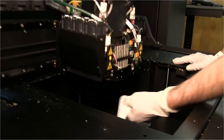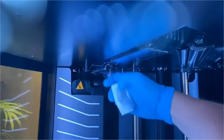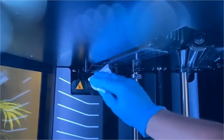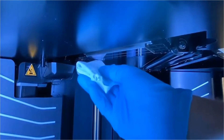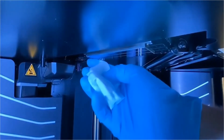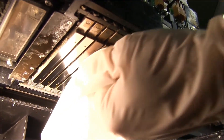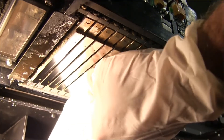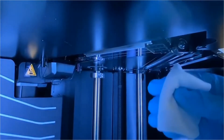After the print, make sure you're available or around the machine to clean the heads off with a lint-free cloth and some isopropyl alcohol, wiping those heads just to remove that excess resin. When you're wiping the heads, you want to make sure that you're wiping in one direction — you don't want to be rubbing back and forth, because you don't want to take that resin you just wiped off and push it back onto the head or deeper into it.